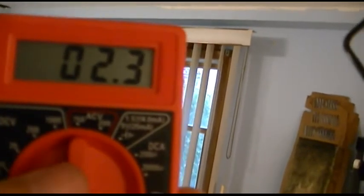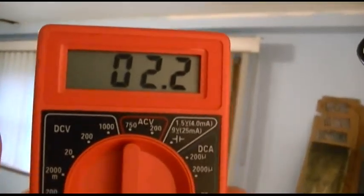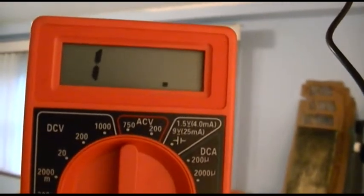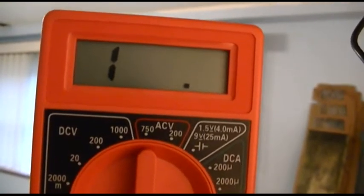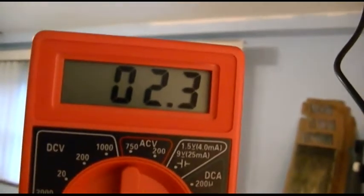Here's the wire that runs all the way down. He's just finishing connecting the switch there. Over here again we're reading as close to zero ohms as this meter is capable. Lock it with the lever - infinite resistance. Open it - not infinite resistance. Lock it - infinite. Open - not infinite. Perfect.